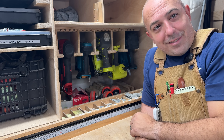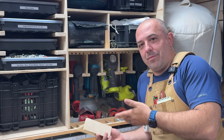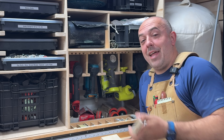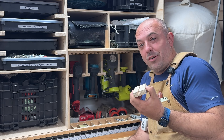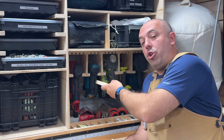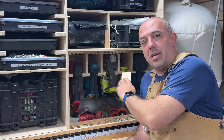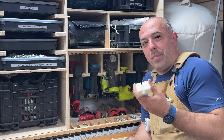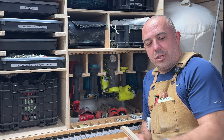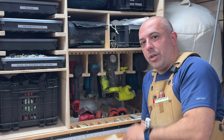When I was editing this video I came up with a better option that deals with my issue — make the bottom plate also with a keyhole router bit. So rather than routing it out like a groove or dado and gluing it in, why not make this adjustable too. This accommodates for the fact that sometimes the spacing won't work. You can make different width bottom plates, slide them on, and if one doesn't work for the next tool you can just slide it off and slide a new one on. That way you're only replacing one small piece of wood instead of redoing the whole structure every time.